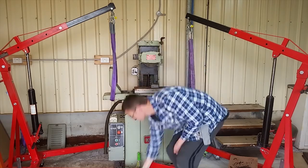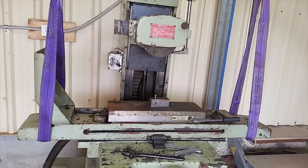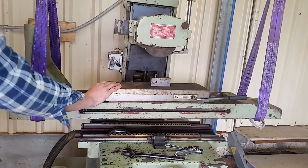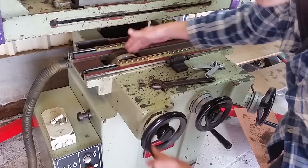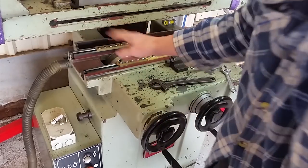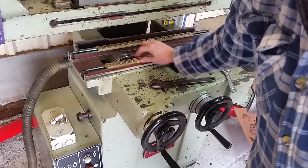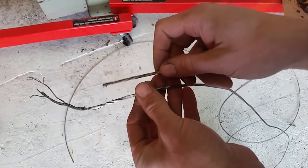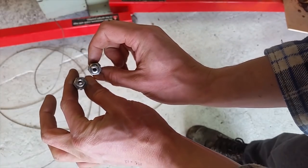Now just cleaning the table and the X-axis traversing mechanism. The traversing mechanism on this surface grinder is this drum here. This braided wire is wrapped around multiple times and locked off at either end of the table — and that's how it travels. These are the now disinfected ball sliders. The old wire rope doesn't have a lot of extra length, it's difficult to handle and terribly frayed. So I've got some new wire, and it's ever so slightly larger. All the tensioning bolts have a through bore and had to be drilled slightly larger.